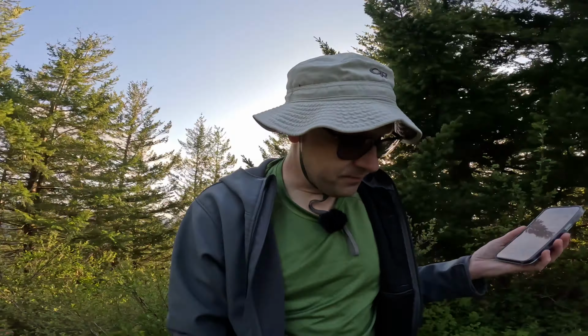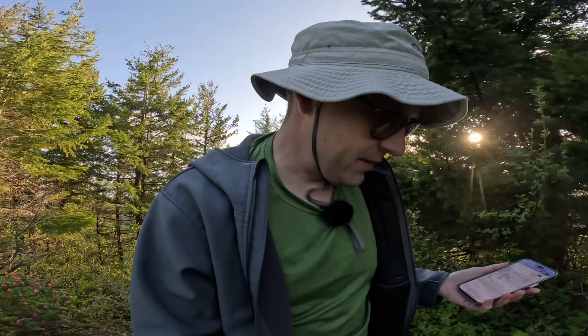And then, just for the fun of it, I tried to QSY up to 20 to see if 20 would work with the end-fed half wave, and it did. I got a couple of 20-meter QSOs, including all the way over to New York, and then of course into Utah. So that worked really well. So I think I'm just going to rely on that end-fed half wave, because verticals are kind of hard to use. They have a smaller footprint, which is nice for places like this, but they're so much harder to use because they have to be self-supporting, so they're almost always heavier.